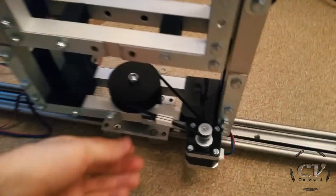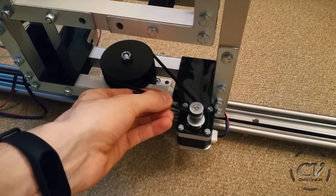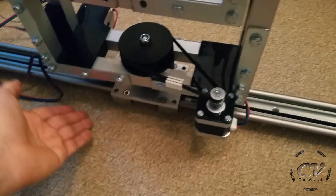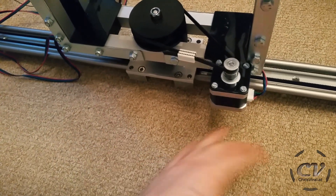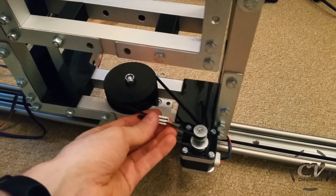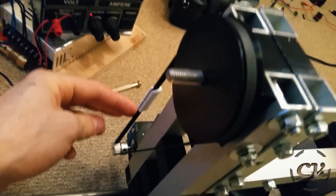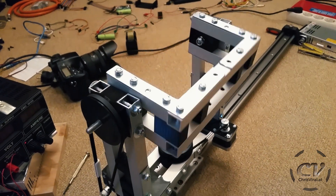As you can see, I still have a few problems to solve. I haven't found a good solution for closing the timing belt. I tried cutting it at a very sharp angle and covering it with duct tape — the sharp angle gives it more surface area so the tape doesn't rip at shorter lengths. But that didn't work out, so I had to come up with a little clip for that axis. For the other belt, it's no problem because it's pretty long, which means the tilt is able to turn quite a bit without the clip causing any problems.